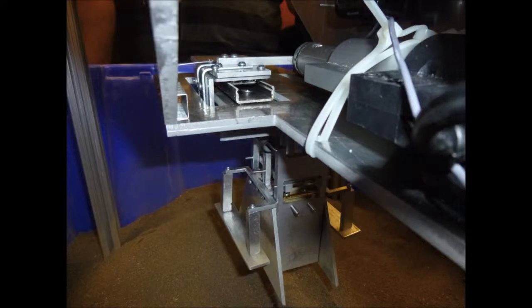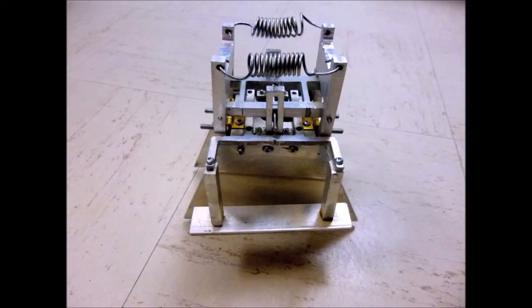The device is designed to cover the shearing box while it is lowered into the soil. Then, at the height where the box is filled with soil, a trigger mechanism unlocks two opposing sides of the outer box, allowing mounted springs to clear soil away in the shearing direction, after which the test can be performed under near-ideal conditions.